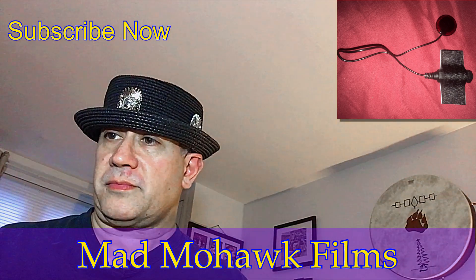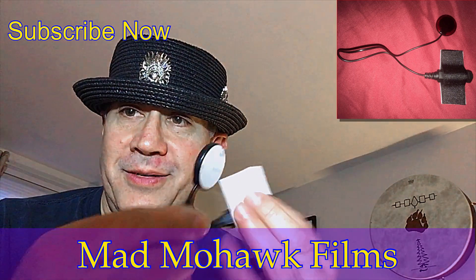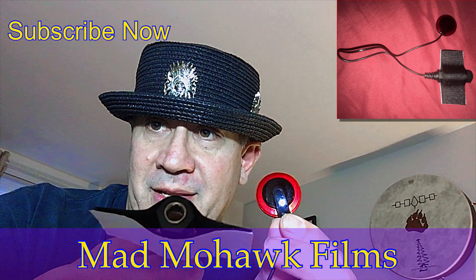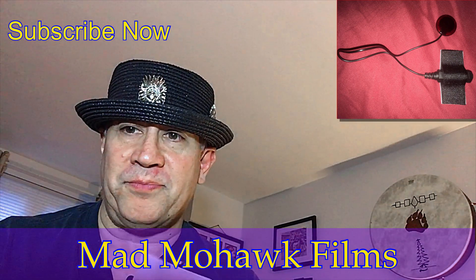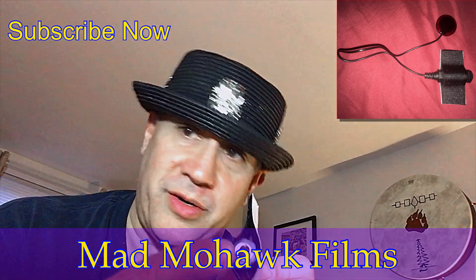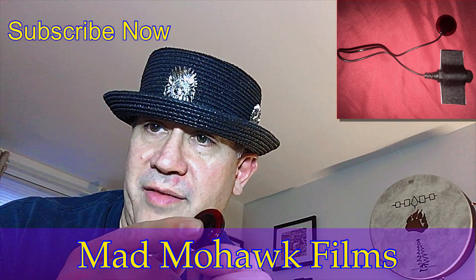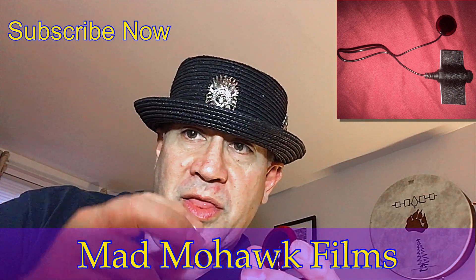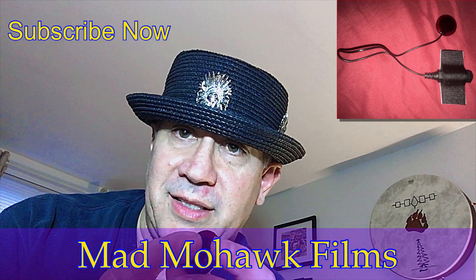So no problem — what do you do when you're a mad scientist? You buy a bunch of piezo transducers with the jack already on them. I paid 20, 22 bucks for eight of these. Essentially you plug the cable for your kick drum, or any other drum for that matter, from your drum module into this, then put a piece of rubber over it. Pretty much any hit on this will trigger it.